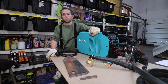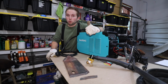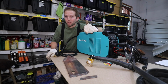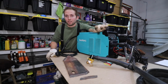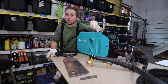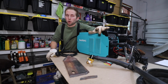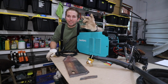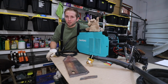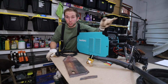So overall, would I recommend this machine? Depends what you're doing. If you have 220, 230 voltage and you plan to cut, you know, 1/2 inch thick steel or thinner, 100% recommend it. Good buy. If you're looking to cut larger, think about going for a higher quality machine. And if you're thinking about doing any kind of work on 110, 115, stick with the thinner material. I wouldn't go thicker than an 1/8 inch. 5/16, it'll probably trip your circuit breaker.